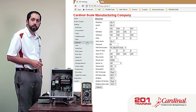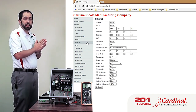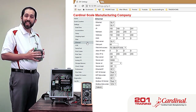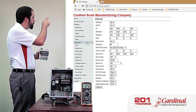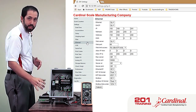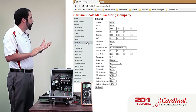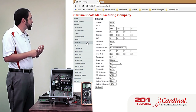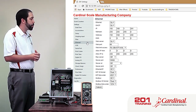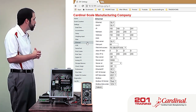The communication is also set up from this webpage. For Ethernet, this is probably the easiest place to set it up — with the 201 display, you can only see one thing at a time, and there are a lot of settings, especially the IP address which has four parts. From here we can turn Ethernet on or off, turn the raw socket connection on or off, Ethernet IP on or off, and the same with Modbus. For most people who work with the 201 regularly, they start using the webpage because it's just a lot easier to work with, especially for Ethernet settings.